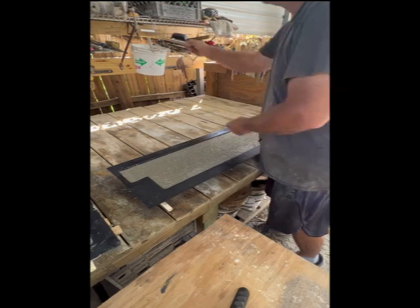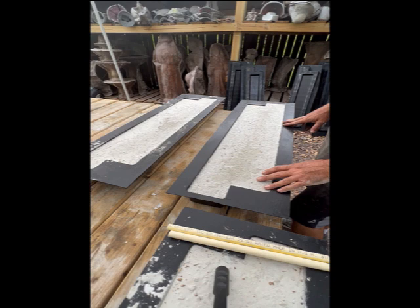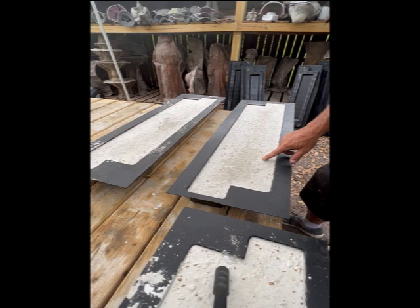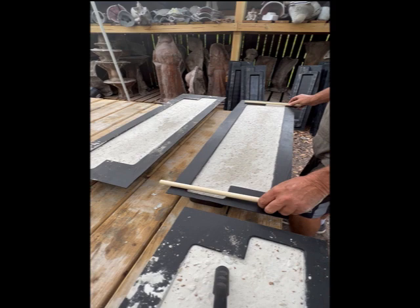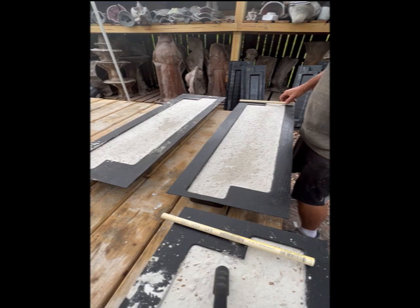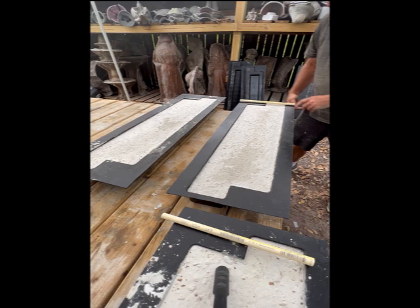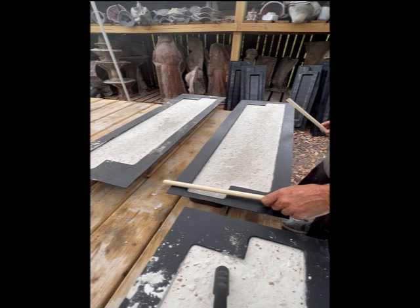This is how you pull the bed block molds. It's been 24 hours since I poured concrete in this. At the 5-hour mark, when the concrete was setting up, you could tell by touching it whether it's set. Usually it's about 5 hours depending on the weather. Then I pulled my pipes out and they come out real easy. If you leave the pipes in the full 24 hours, you're gonna need to tap with a hammer — use a rubber mallet just in case you slip and hit. Tap it out, pull it with pliers. It's a lot easier if you catch it at that 5-hour mark.